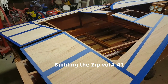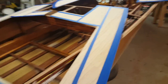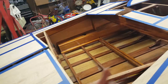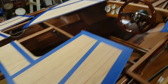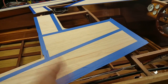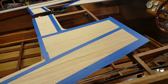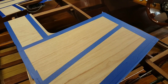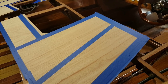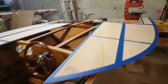We now have all of the planking pulled back off for the sub deck. I masked off all of the contact points - everything I outlined with a pencil when this was upside down. It's now flipped over and I've taped off all of that framework because when I glue and screw these down, I want to be gluing wood to wood surface with epoxy. I don't want to coat with epoxy and rely on a mechanical bond.